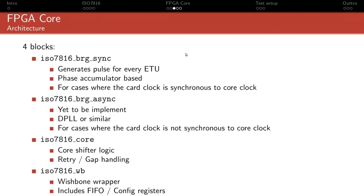And so this will basically generate a tick rate that's approximately the right baud rate, plus or minus one clock cycle. You have some small jitter because you have to generate things aligned to your system clock, and the baud rate that you might be asking for might not be an exact divider, so you can't be more precise than that, but that's the best you can do, basically.